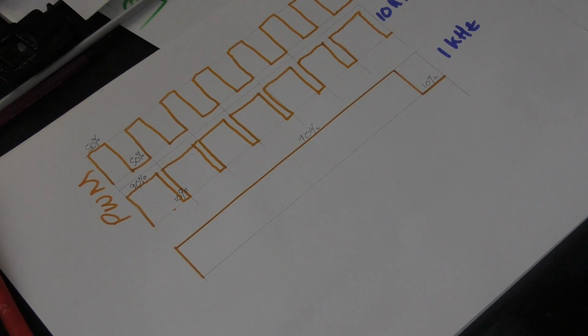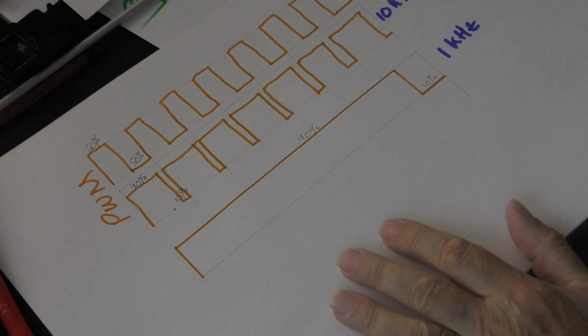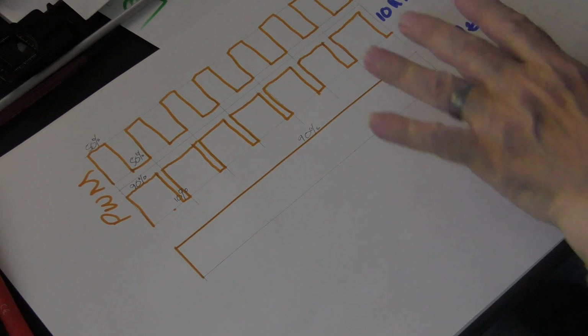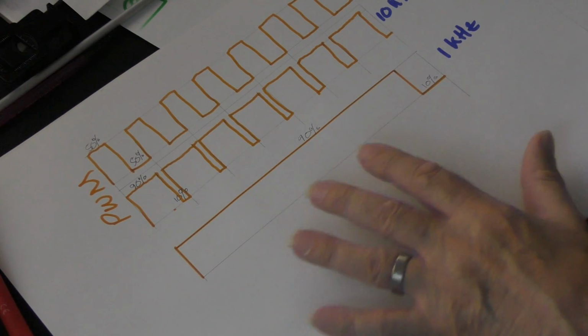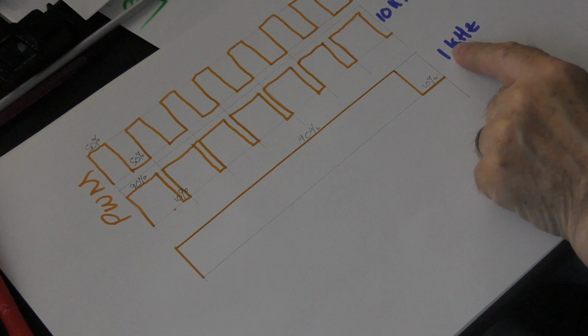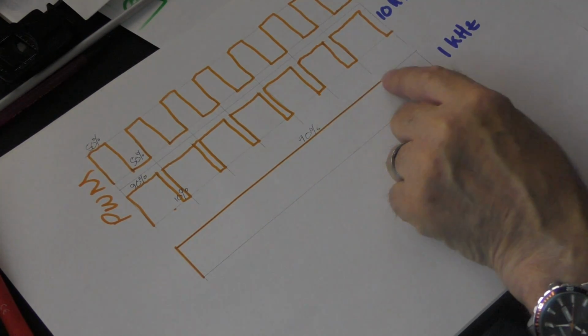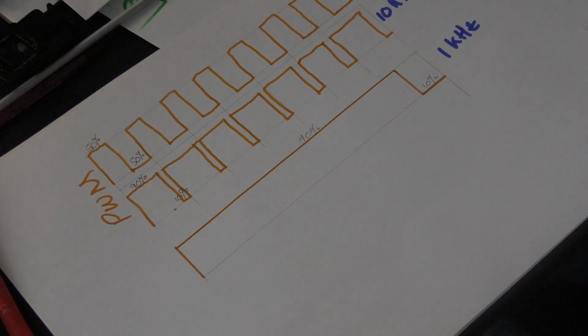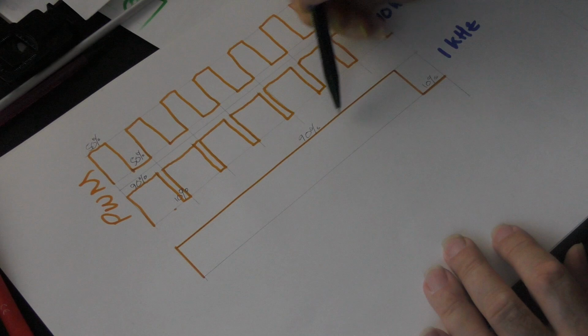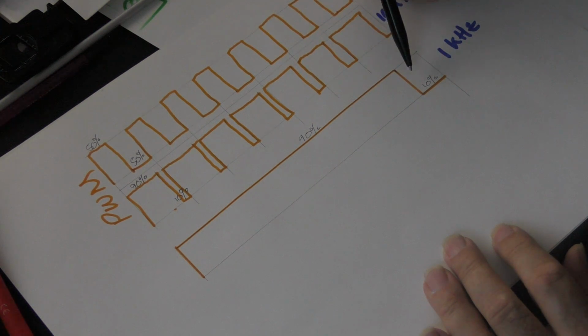If you remember back, I admitted to making a bit of a mistake when I set the PWM for one of my tests. Instead of 7.7 kHz, I set it to 1.7 kHz. Well, look, I'm going to simulate the same sort of thing here on this model by, instead of using 10 kHz, we're going to use 1 kHz. And what that basically means is I'm going to get 1/10 of the pulses, 90% high and 10% low, which is my percent power setting that I'm using. Just because I've got this set to 90% power, it's 90% duration, not 90% power. The power is always 100%.